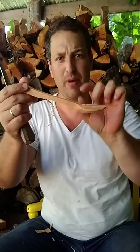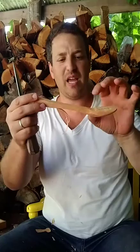I'm just knocking off the back weight of the shoulders here. Then I'm using the chest pull to pull down towards myself, creating the line I want for the bottom of the spoon. It's not a perfect parallel mirror of what the top line is doing — what I prefer is to have it taper over the course of the handle.